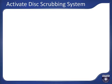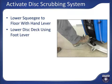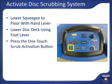Activating the scrub system is different depending on disc or boost style decks. For disc machines, use your hand to lower the squeegee to the floor so that you can recover the used solution. Lower the disc scrub deck to the ground using the foot pedal on the back right of the machine. Push down and shift your foot to the right to allow the pedal to rise and lower the scrub deck. Press the one-touch scrub activation button — this will arm the scrub deck, solution system, and onboard chemical dilution system if present on the machine.